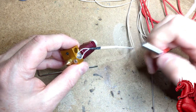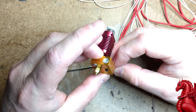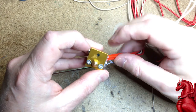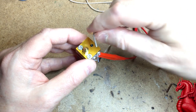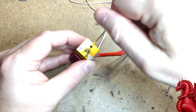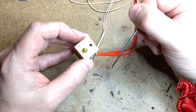You can get batches of heater cartridges on Amazon — I'll link heater cartridges, hot ends, and thermistors in the video description below. To put the new heater cartridge in, just do the reverse: slide it all the way in. You want it as close to flush on this side as possible so you're not putting stress on the wires at that drilled edge. Keep your finger on that edge so it pokes out just slightly, then tighten down the grub screw. You do want that tight — you do not want this coming loose while you print.